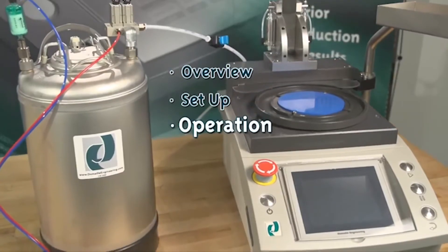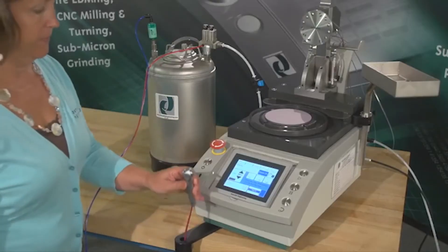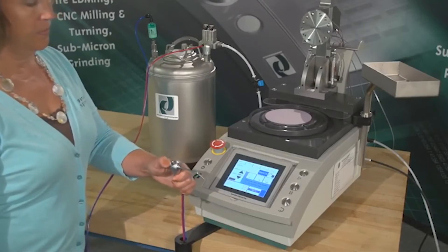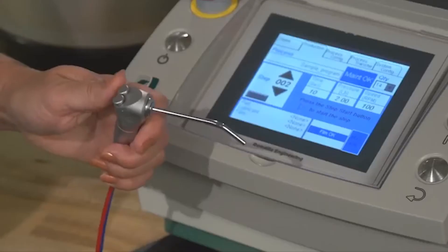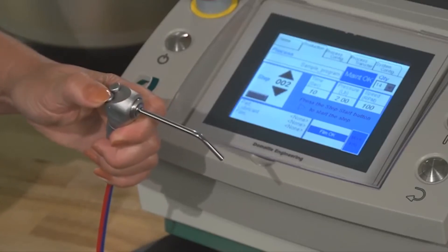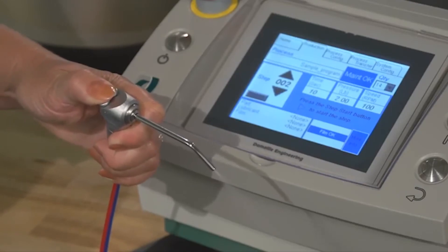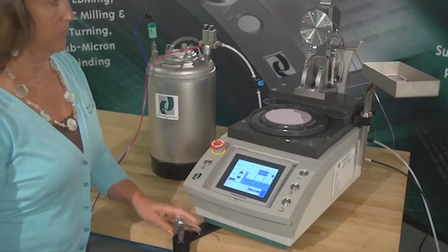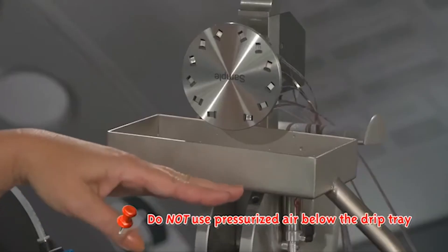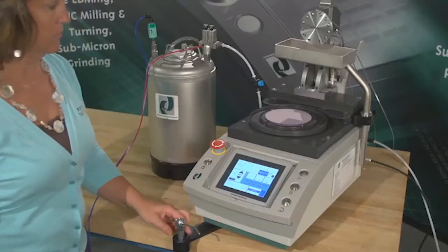Step 3, Operating Your Air Cleanse System. The wand is equipped with both air and water buttons. These can be used separately or in combination to provide a pressurized mist. The left button will spray water only when pressed. The right button will blow air only when pressed. Holding both buttons down together will produce a pressurized mist. Important: do not use the pressurized air below the drip tray, as this forces water and contaminants into the precision wear surfaces and mechanical drive unit.